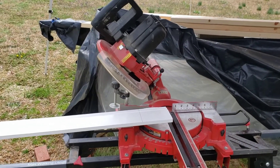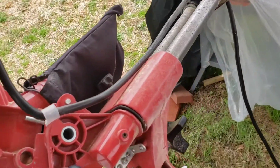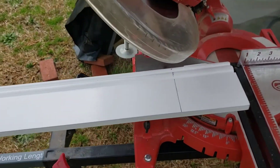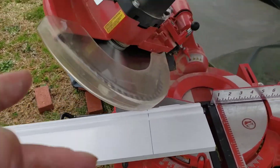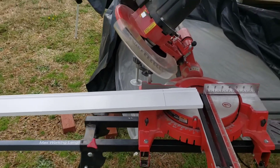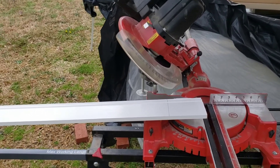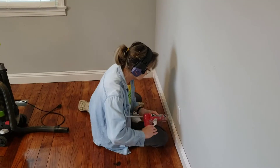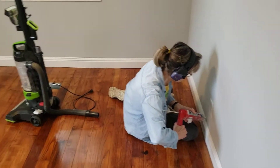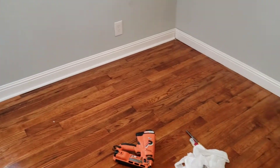This is when I have to angle the saw, which is controlled by that knob right there, and put it at 45 degrees — because the material is too tall for the motor to come straight down. I've got my mark and the angle I need. I'll bring the board up and cut it. Jane is now doing her caulking and we're into the quarter round.